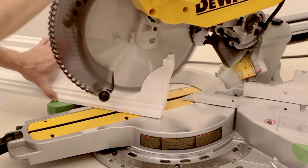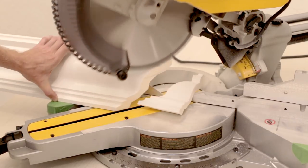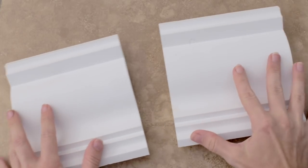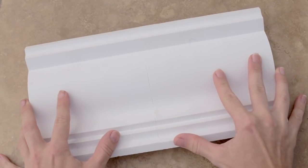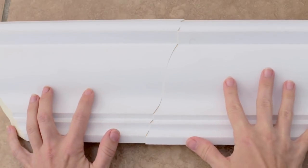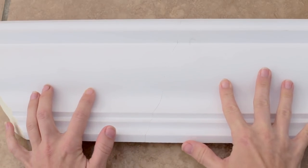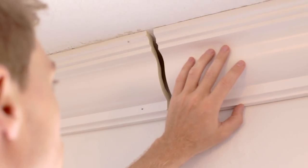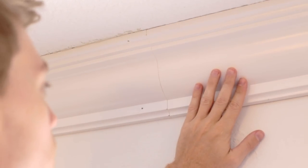Since this is our first piece, we're just trimming off the very end. Before we nail it to the wall, we need to trim the other end as well. When it comes to connecting your molding pieces, the easiest way is to simply butt the straight cuts up next to each other. Most carpenters recommend cutting your joints at an angle to minimize the visibility of the seam — this is called a scarf joint. But with this material there was no noticeable difference in the seams, and since it won't expand and contract like wood does, we kept things simple and made straight 90-degree cuts.